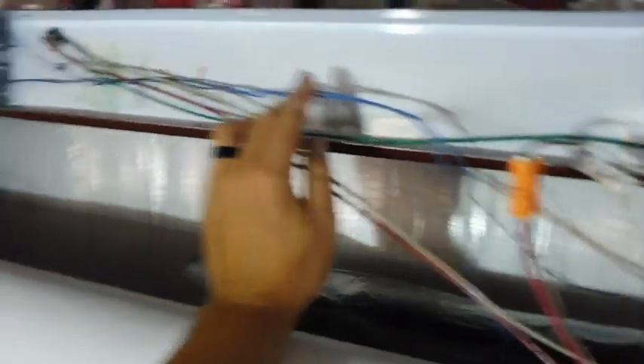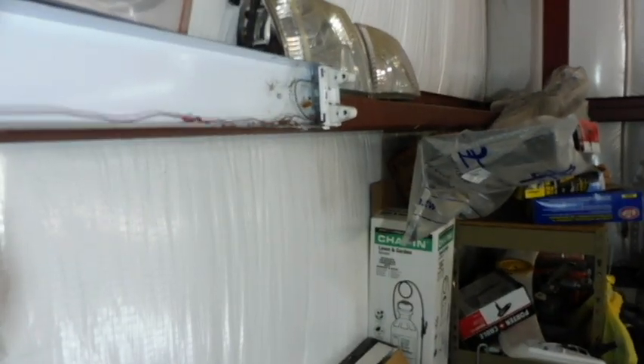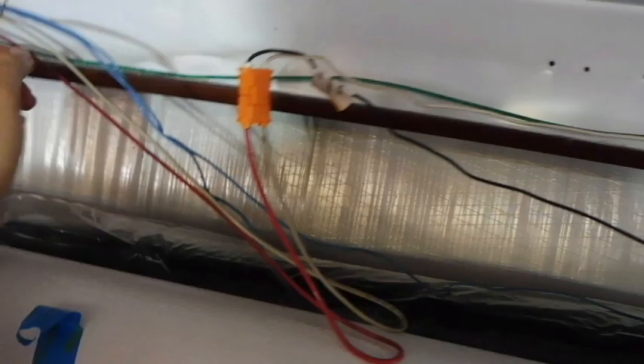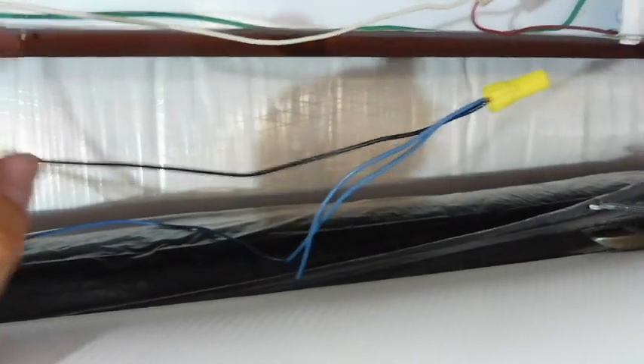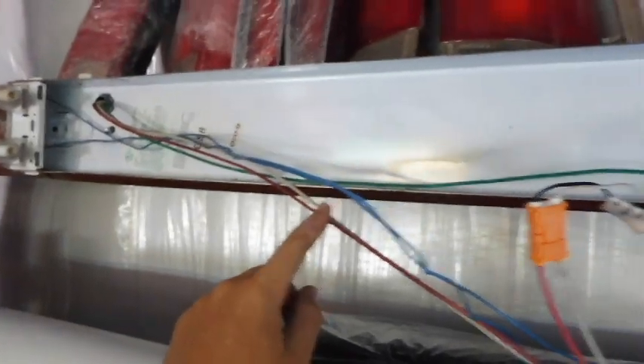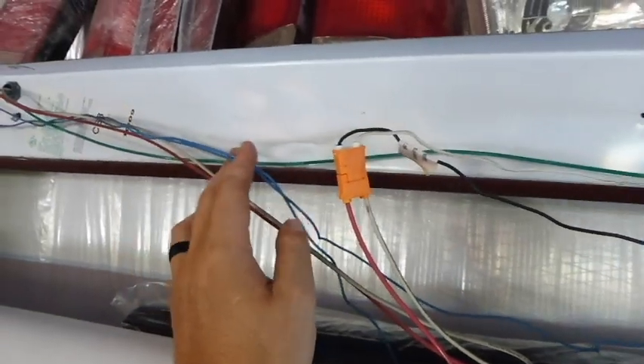So we got the first one done. You'll have one end that's just got one wire going into each tombstone. Then on the other end, it actually has two wires going into each one. On this end, which is going to be the blue wire, you want to run this to your line, which is the black. The way they had this building wired up, it's actually red, but typically it'll be black. The end with two wires is going to go to your neutral. Now we're going to clean these wires up — I left them long just because I was testing everything. The wire color is a little different than what I'm used to in the older stuff. So I'll clean this up, get it tucked in nice, put the covers on, put the lights back on, and then we'll show you how they look.